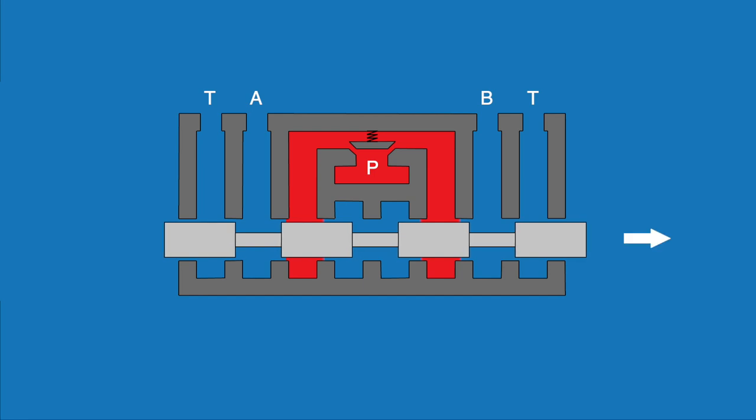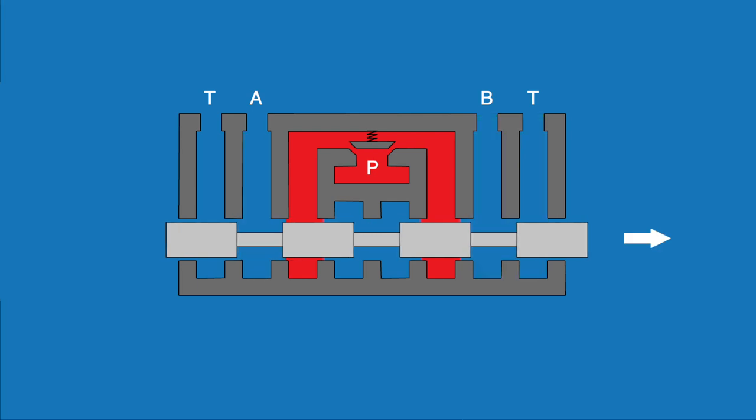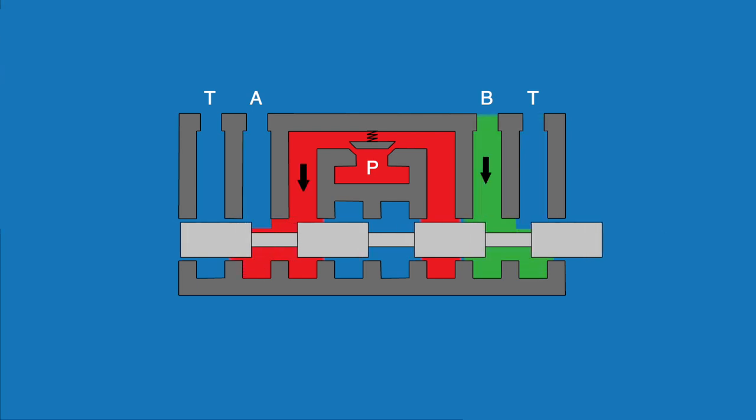When the spool is moved to one side, in this case to the right, it allows the pressurized fluid to travel through the A port to the hydraulic cylinder. As the hydraulic cylinder either extends or retracts, it pushes hydraulic fluid out of its other port to the B port of the valve body. Notice that the spool also connects the B port with the T port, which allows the hydraulic fluid to return to the hydraulic reservoir. At this time, I have not figured out what the 2 center chambers are used for, so if you have an idea, leave a comment down below.